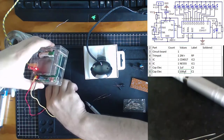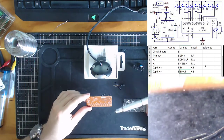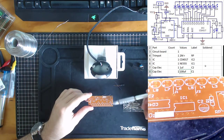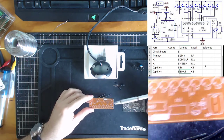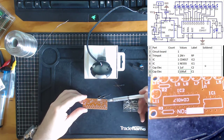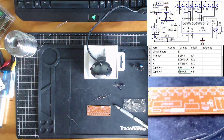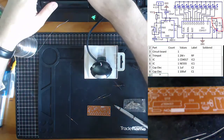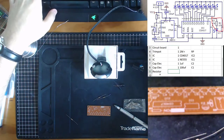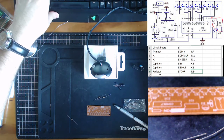For their location, looking at our board: resistor 1 is 1k, and resistors 2 and 3 don't have values listed. We can assume they're 470s. Checking our circuit diagram, resistors 2 and 3 are both listed as 470 ohms — good. So we record resistor, quantity 2, value 470 ohm, location R2 and R3.